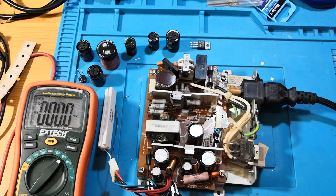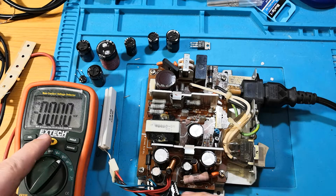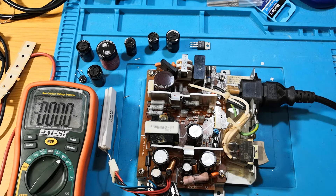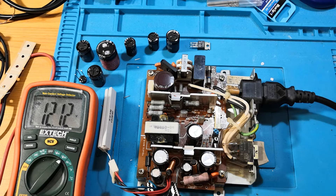Here we are, back with all the remains I've taken out of the power supply. I've got the load resistor back on the 5 volt line — this is hooked up to the 5 volts. Let's turn that on, switch it on and see what happens. Okay, nothing exploded — this is good. We've got 12.13 volts on the 12 volt line — that looks like a more sensible number. Last time we had 10.